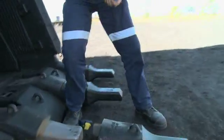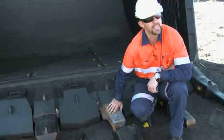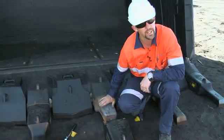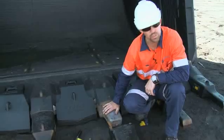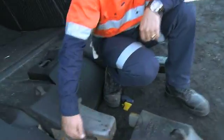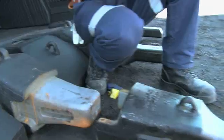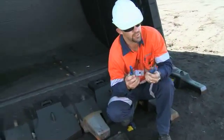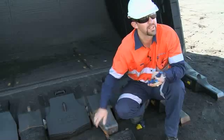The other section of the new style that has changed is the nose of the adapter. The old style did have a more curved effect here. What we were finding was that the dirt would actually compact there and actually hinder pulling the tooth off. This new style is a lot more flat and that's to alleviate that issue. These grooves on the side here — please when you're removing your tooth, pull your little inserts out and clean out that section, because if you don't, you'll very rarely get it to line back up. It just makes it a little bit quicker and easier.